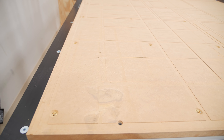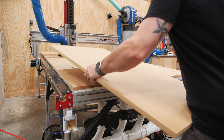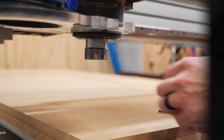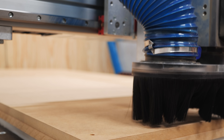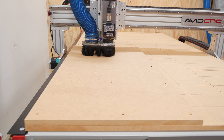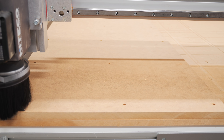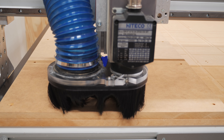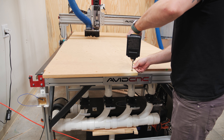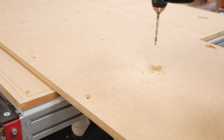I installed the rest of the threaded inserts in the spoilboard, then got the T-track table base panel mounted on the spoilboard, closing all but one of the valves on the vacuum to focus the airflow to that area. The next program cut the through holes for mounting this table to the spoilboard — I used a quarter inch down-cut bit for this, but didn't cut the holes all the way through to avoid accidentally running the bit into the threaded inserts below. I chamfered the mounting holes using the same 90 degree V-bit so that the mounting bolts would be countersunk below the surface of the panel, and then drilled the holes all the way through with a drill before mounting the panel to the spoilboard using some brass machine screws.